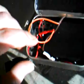On the other end, I have the USB hooked up, and also hooked up to this little LED in the corner, which lets you know the unit is powered up and ready to charge. I use hot glue to seal everything in and hold the switch in place. The battery box also has its own on/off switch so I can turn it on and off whenever I just want to maintain the battery specs.